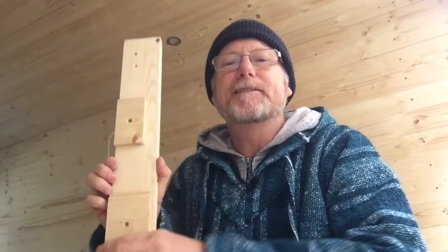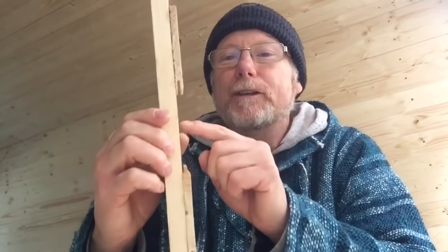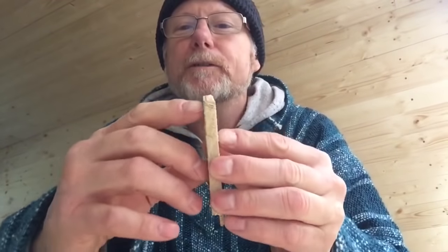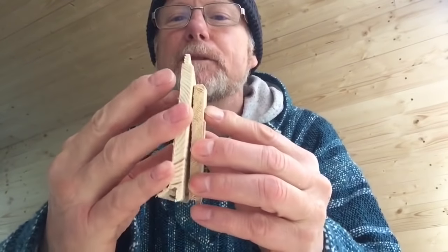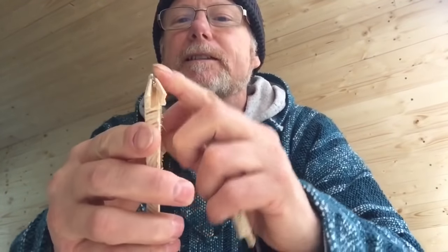This piece of wood represents my battens, and these two pieces represent my slats going across. The slats are tongue and groove, and once they're interlocked that middle one — there's no way you can remove it without destroying it. So I slightly modify one panel to make it removable, so I can get to my wires for maintenance and modifications. I've modified a piece of cladding — I take the tongue off the top, and at the bottom the groove, I take the back piece away and simply remove it.